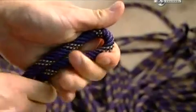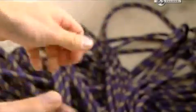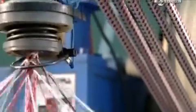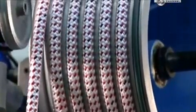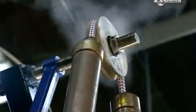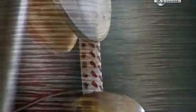A sample rope is pulled out and its flexibility and strength are checked. Now, another Maypole braider weaves a synthetic rope that's stronger than steel, yet lightweight and flexible. That's because the strands at the core are braided with a material called ultra-high molecular weight polyethylene — a high-performance thermoplastic. This rope will be used for yachting. A pulley draws this high-tech rope through some metal pipes filled with steam, which shrinks the polyester jacket around the powerful core for a tight fit.